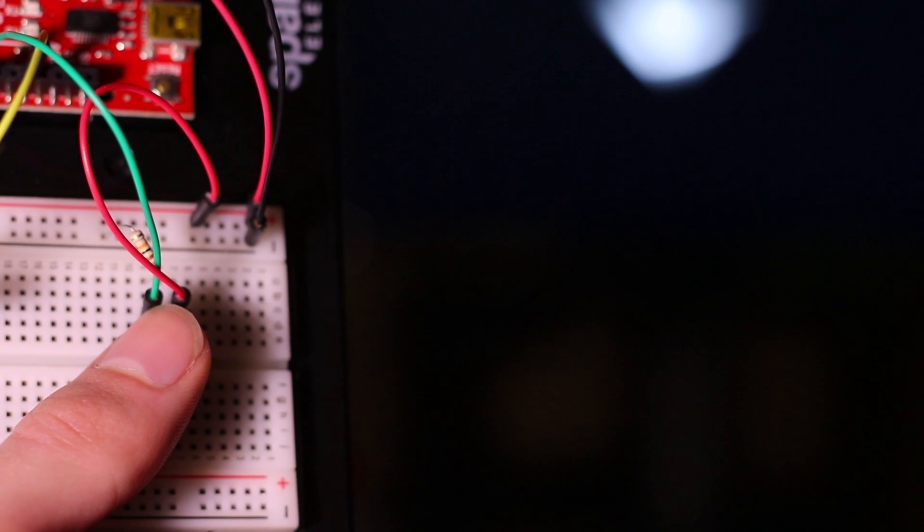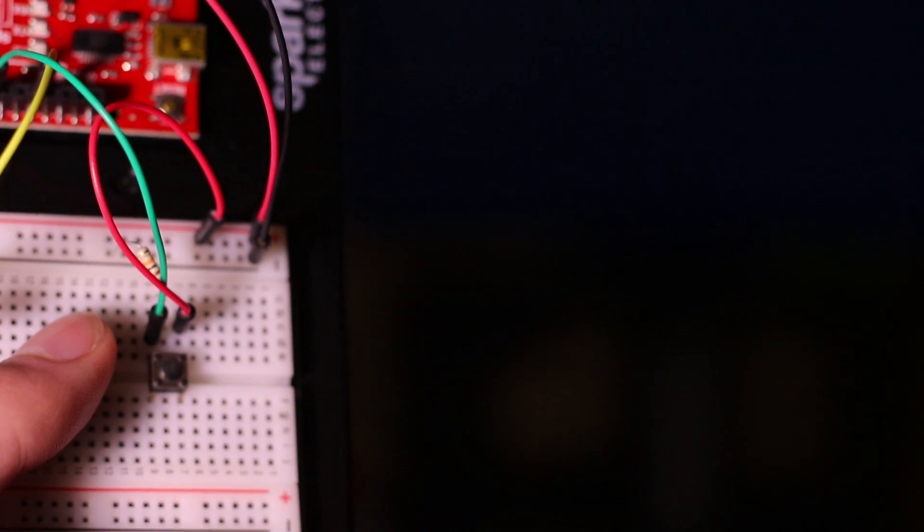Get ready to turn on your TV. If you did everything correctly, you should be able to walk over to your TV, press the button on your Arduino, and turn your TV on or off. If it doesn't work, try walking around your TV and placing the LED in different spots. If it still does not turn on, try recloning the code from your TV remote or go over your code to see if you made any mistakes. If you have any more questions, please leave them in the comments below — I'll try to answer them as soon as possible. Thank you all for watching, I hope you enjoyed, and I'll see you in my next video.